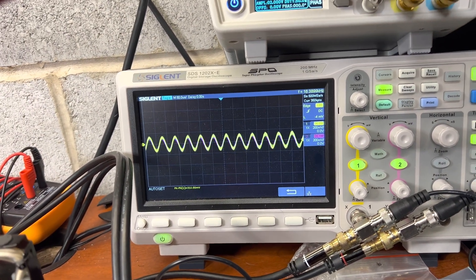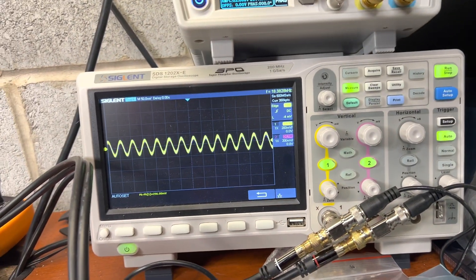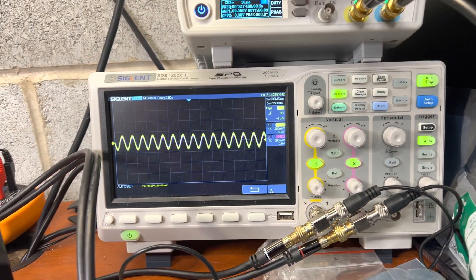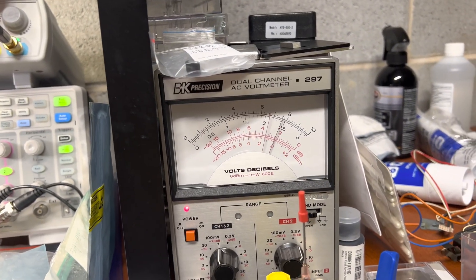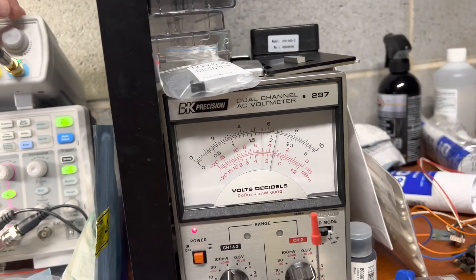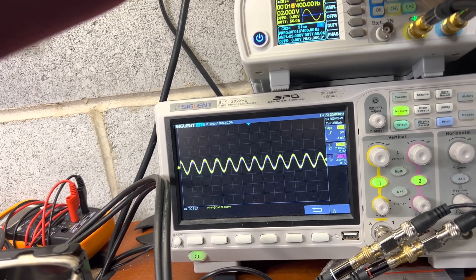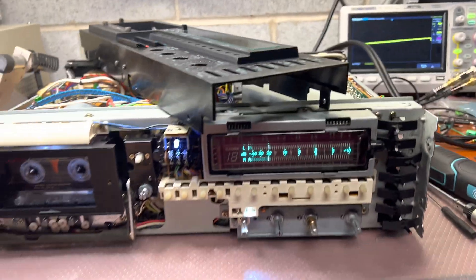16, 17, 18 — needles. 19, 20. 21, 22 — channel one has a little bit of drop, about 1 decibel. 23 — here we have a drop. So minus 3 decibel is at 23 kHz, 400 Hz on type 1 tape. Nice, I like it.